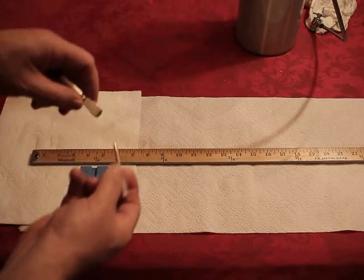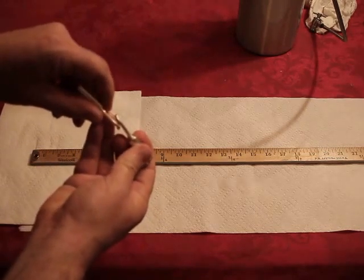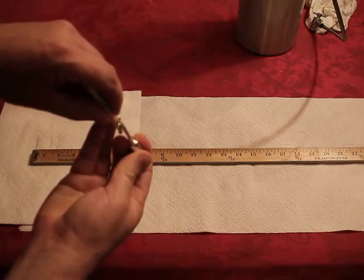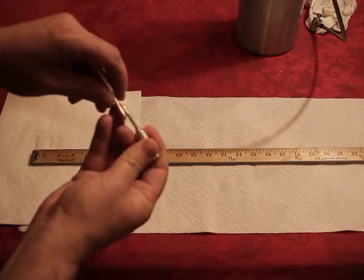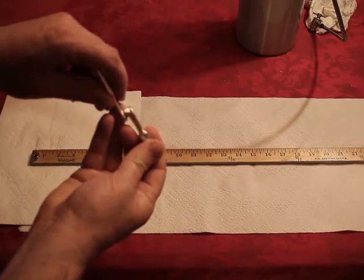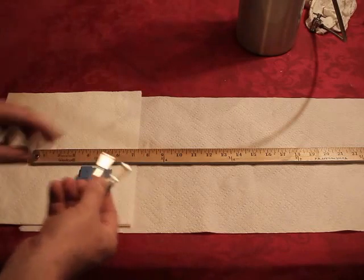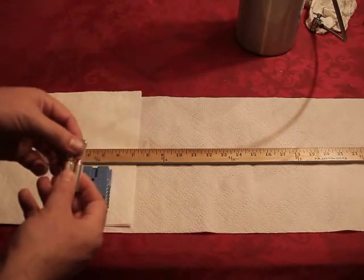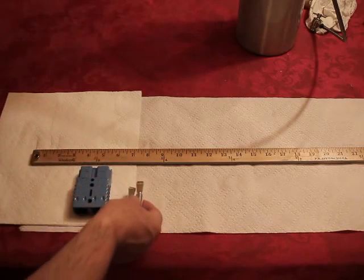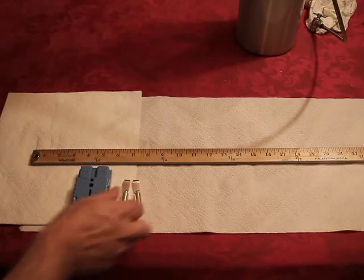Look at those surfaces — it takes two of these and when you put them together they ride like this. As you can see, the surface is not really flat; it's going to contact in two places at best. This is a two gauge cable, and if you know anything about electricity, you know there's not a chance in a million that this is going to handle 500 amps.